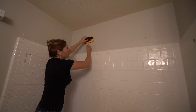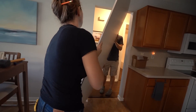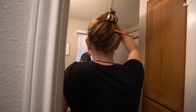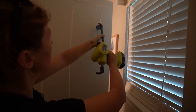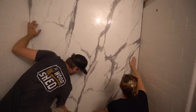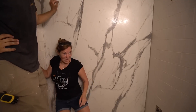Use a stud finder to find and mark your stud locations, then attach your wooden boards to build out the section. I applied wooden battens on the other two walls, then moved in the back panel — you definitely want a hand moving in the large sheet since it's big and awkward. I ordered mine in one large sheet, but you can also get this in tongue and groove, which is great for tight spots where a full panel won't fit. I used the proprietary caulking from Wilson Art that comes with the DIY kit, staying two inches in on all sides — running a horizontal line on top and bottom, then a vertical line every 12 inches in between. David and I got the panel in by taking our time and working around the obstacles. It sets up in about 10 minutes, so I pressed it firmly against the tile and wooden battens.